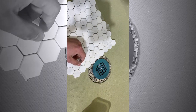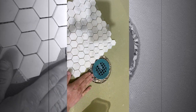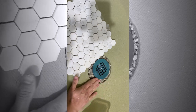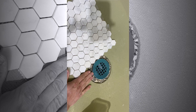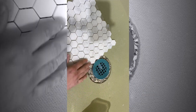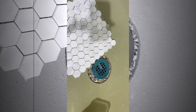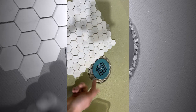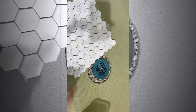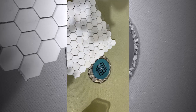So you put the stones around them, and then really just get the grout on top of it. Don't fill that with grout, because then you're gonna make it even worse. So just get the thin set right on top of those. Don't pack it in. This way, when it gets there, it dries right out and goes right down the drain. And that's how these drains are made. And really, that's very important, especially with porous Carrara marble tile.